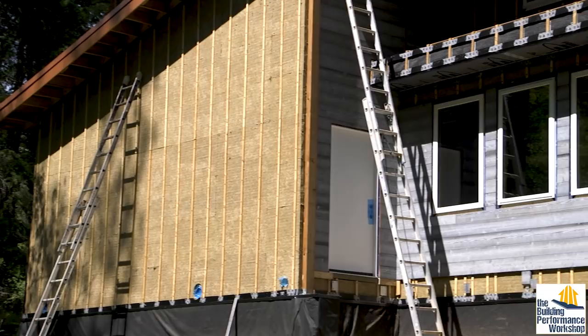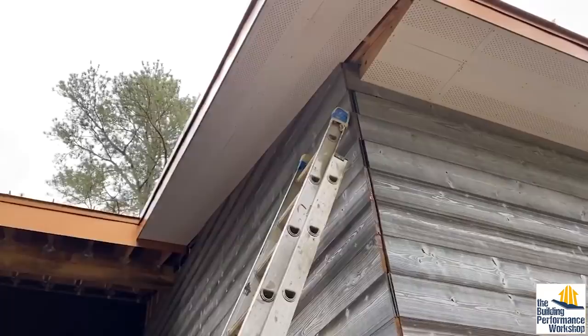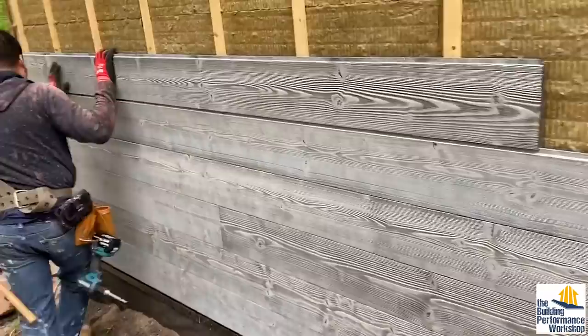Because if you try to shape wood that's completely dry, it's going to break. It's not really the way that wood is supposed to be — it's going to get its humidity back somehow. So they introduce it back in a controlled environment, then they shape it again. And they end up with what is essentially defect-free batches of siding, decking, whatever you're looking for. So it's 100% usable. You're not going to cull any bent pieces of wood out of this.